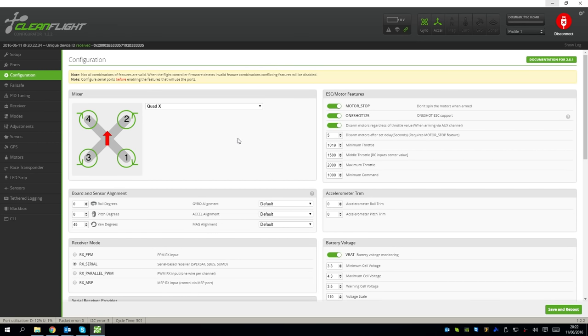So we've got quadcopter X selected there. And we've got motor stop engaged, OneShot 125, and the disarm button. And these for now are the minimum values. I do change those in a bit. We need to have the VBAT selected for the telemetry. And then you'll notice over here, I have got the yaw set to 45 degrees. And that's going to change the orientation of the board. I want to make sure that serial RX is selected. Just going to scroll down here